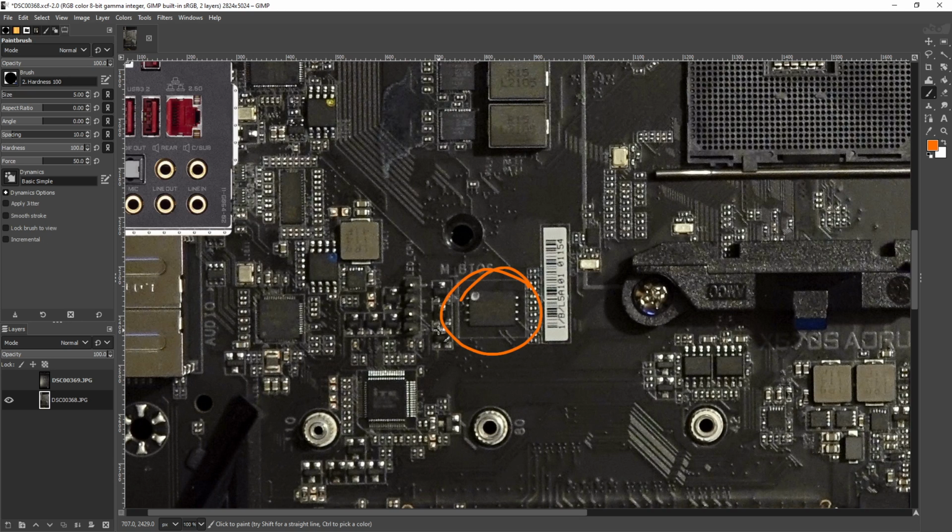So yeah, you're basically always stuck with the automatic dual BIOS system with Gigabyte. Basically, you either have automatic dual BIOS without switches, which is horrible, and that's what you get on, say, the B550 Aorus Master. That board is very capable, but the fact that it has automatic dual BIOS without the switches is just infuriating. Or you can have a motherboard with automatic dual BIOS and the switches to turn it off, which is fine. That's great, assuming that you actually figured out how to disable the automatic dual BIOS.